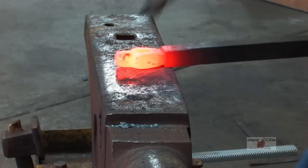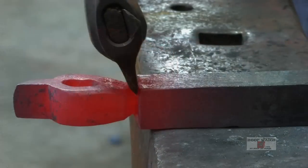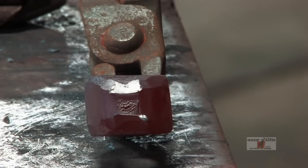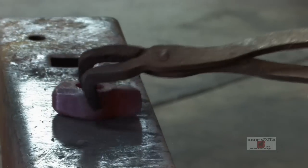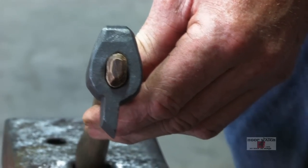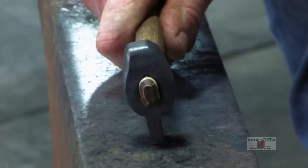We've got all the cleanup just about done. We're just gonna cut the head of it off. Try to get the cut off all on the inside. I'll put that in the vise and just soften those edges. All right, let me just flip it over. We've got the blade in the center of the eye. I might be a little weak on the blade side of it, but I'd rather have it be a little shorter than a little longer because it's easier to steer with the sledgehammer hitting it.